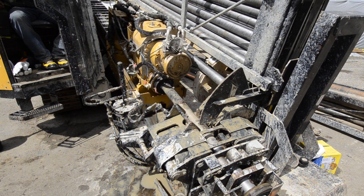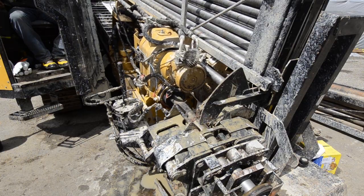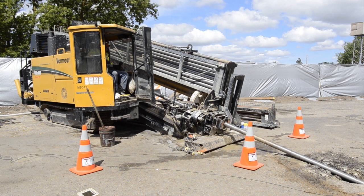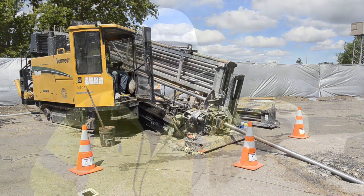This is probably the toughest bore that we've done so far. We just completed one with the same machine a couple weeks prior — that was about 1,100 feet with one 6-inch conduit. This one being 650 feet is a little shorter, but a 20-inch water line, a 20-inch pipe, brings its own challenges with all the back reaming, especially in the rocky conditions that we're in.